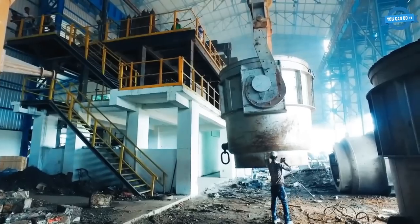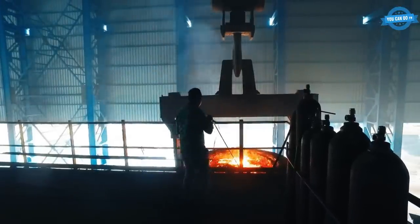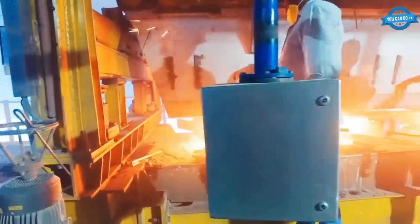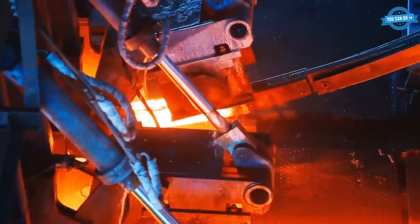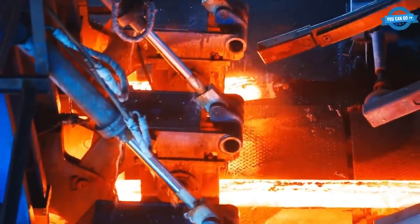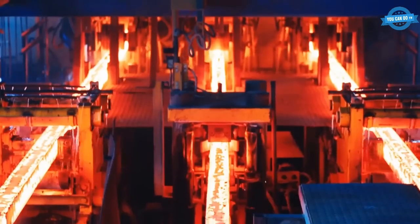For example, the temperature for lead-free cutting is 1305 degrees, and the temperature for tire cords is 1275 degrees. Once the steel is judged ready to roll, the VIC crane starts to draw the blooms from the pit and set them on the ingot buggy. The speed of the bloom is slowed so as to present a good front end to the mill. Once loaded on the buggy, the bloom is sent to the pusher, which discharges it onto the mill racks.